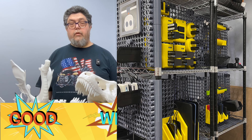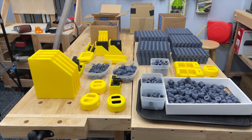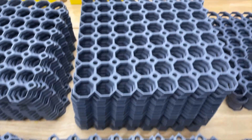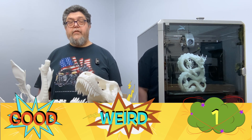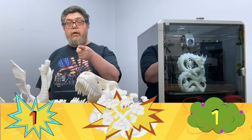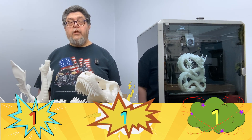The real speed benefit is in real-world printing. I'm printing 8x8 multiboard tiles for my new charging station. On the Ultimaker S5 the tile takes 5 hours and 27 minutes, but on the K1 Max it takes 2 hours and 46 minutes — almost exactly half the time. I also have the Bambu X1 Carbon, and when it comes to single-color printing using standard settings, the K1 Max consistently outperforms it. The K1 Max earns its first good for overall speed, but also its first weird because Creality so poorly documented how users can repeat the settings shown in their demo Benchy.